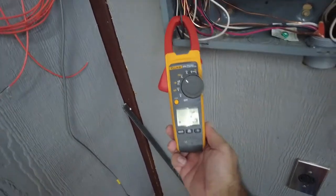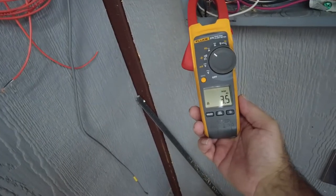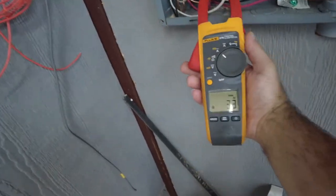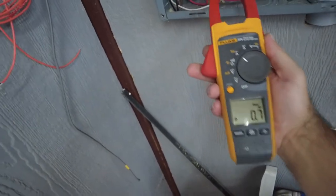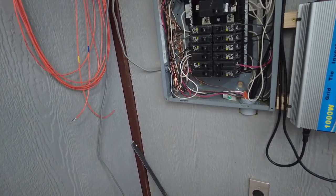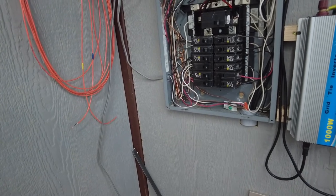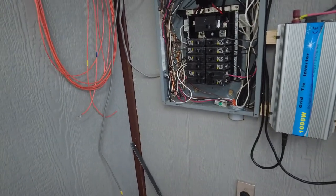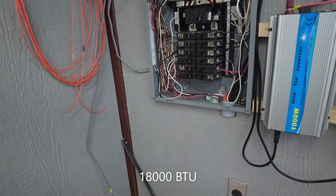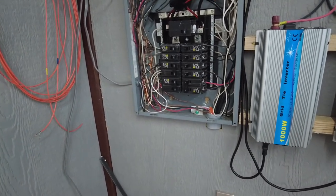This thing is running and cooling right now, and I'm powering both units from my shop. Eventually when I get more batteries on my solar setup I'll be able to run those two air conditioner units off-grid. Right now it's drawing three and a half amps, and that'll drop down to about two and a half when it gets closer to temperature. This is a 240-volt unit. I have a 12,000 BTU regular wall-mount air conditioned unit in my shop and that thing draws five to six amps on both phases. This 18,000 BTU is cooling our kitchen, dining room, and front room area.